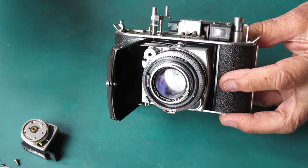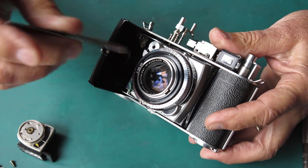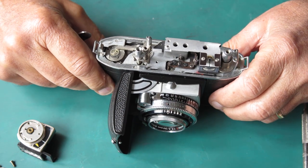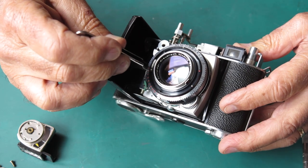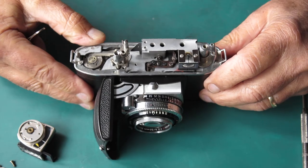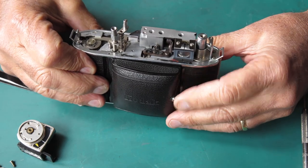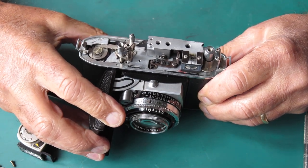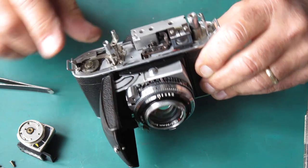The first thing that's likely to happen is if there's a return spring underneath here - and yes there is - on that shaft, if you lift this out that spring will probably just fly away. It wouldn't be bad if it fell on the table, but it won't. What it does is drop down into the gap between the shroud here in the bellows and the folding front section, and it hides away in a corner. Then you might find you can't close the front of the camera, or worse still can't get it to lock into position because the spring has jammed between two surfaces where it doesn't belong.